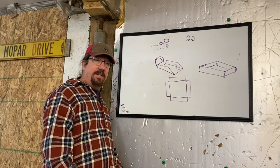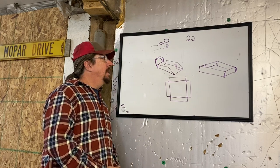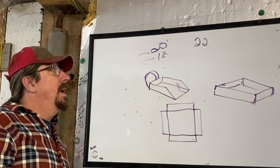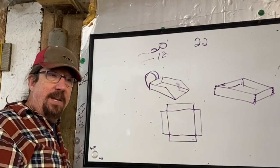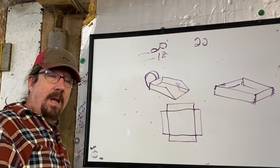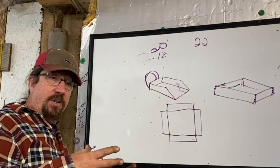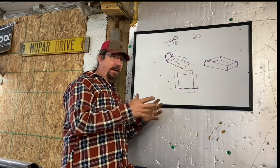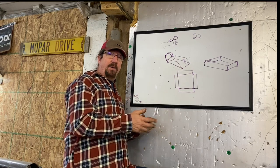Make sure you wear safety glasses. You might want to wear gloves — I happen to hate them, which is why you've seen me end up in the hospital a few times on the channel. 18 gauge or 20 gauge, or 22 — really thin — is a lot easier to work with and maybe a good place to start. You don't have to go out and buy a big 4x8 sheet. Tractor Supply locally sells small pieces, though they're a little expensive. I'd suggest rummaging around salvage yards — you can walk out with a nice variety of sheet metal pieces, angle iron, and square tubing to make your own fixturing and tooling to start learning how to form metal.